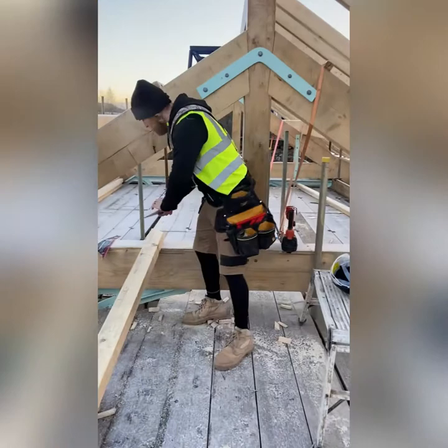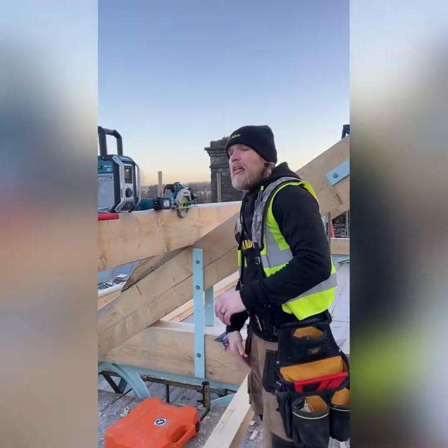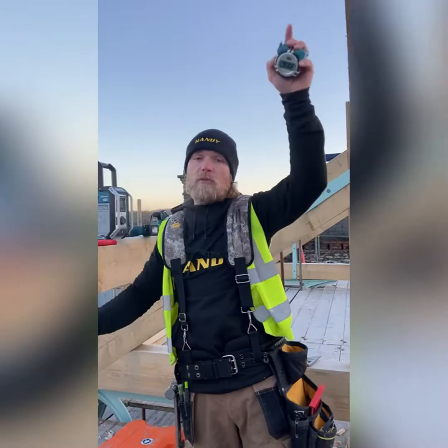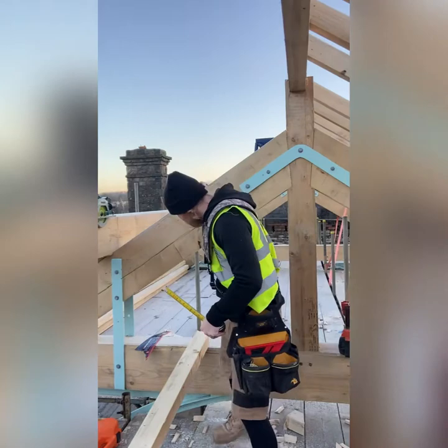Here's one I've done earlier — that's our top cut for the ridge. Now, I know how much I need to take out of these rafters. It should never encroach more than a third of the depth of the timber. With 100mm timber, I wouldn't recommend going any more than 33mm to the corner of your bird's mouth. On this roof setup, we have to take out 20mm for our bird's mouths to get our plane from plate to ridge matching through.